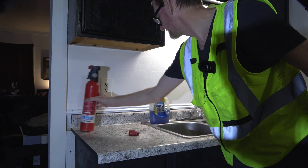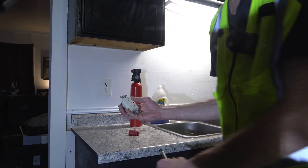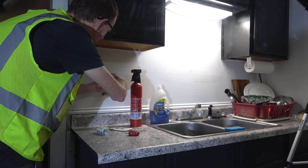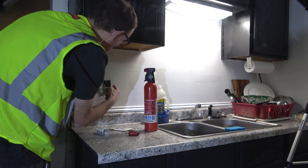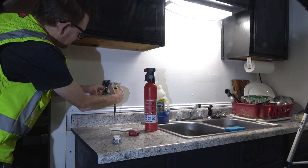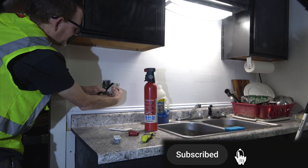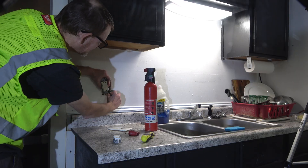I don't have to run down there and shut that off. I'm going to switch this out. I'm going to use this almond off-white outlet specifically because it has a red LED when it's tripped and a green LED when it has power. You'll note that there is no actual ground wire — this is perfectly up to code and they just ground through the conduit, so those screws holding it into the conduit provide the ground. When you're changing these from non-GFCI to GFCI, you may find it's a pretty tight fit in the box. Put a little tape over these screws just to make sure it can't come into contact with that metal box.